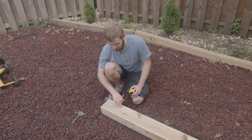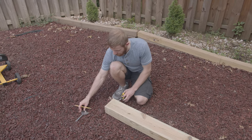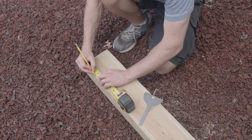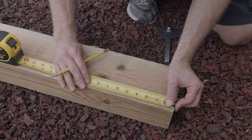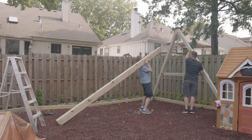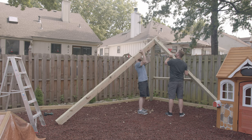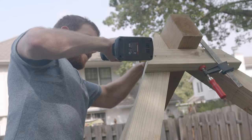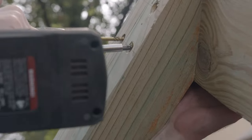Alright, so the last step is we're going to actually transfer a 5 degree angle onto this board to get our 5 degree angle going down with the 4x4s. And before we do, we're going to go ahead and take this tape measure and measure 4 inches in, and then we'll go ahead and mark our 5 degree angle. You want to have one person hoist up the 4x6 while the other person holds the A-frame, and you can slide the 4x6 into the gap of the A-frame. The length of the 4x6 that you'll be using will be dependent on what types of swings and how many swings you're going to be using. Before attaching the other A-frame to the swing set, you want to securely mount those 4 inch lag screws into the 4x6.